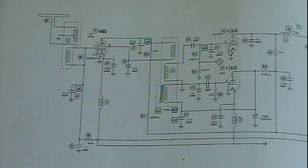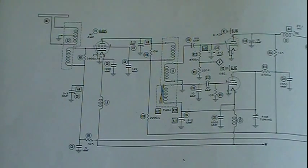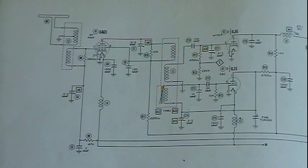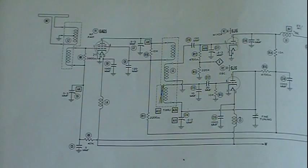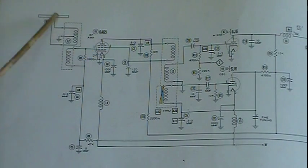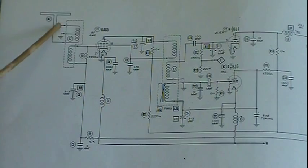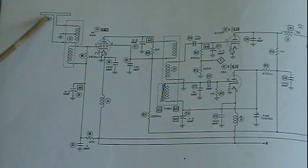Now, we're going to look at the tuner. The video might be a little long, but it's going to go kind of quick, because I already talked about a lot of the information on both the tuner and the IF when I was comparing. So there's not a huge amount, but there are some things I want to point out. First of all, I want to pick out the components in here, the tubes, and what they're doing. Right here you've got the antenna circuit. Right around this area is where you connect the antenna on the back of the TV set. Wires will run into the tuner.